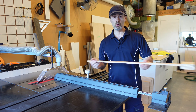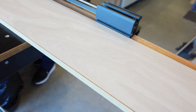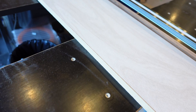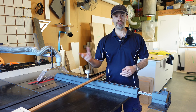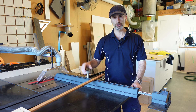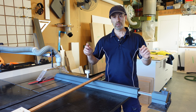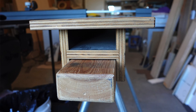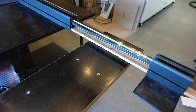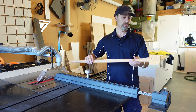So it's a quick and simple little hack to get a little bit more length in your material when you want to do repetitive cuts beyond the standard stoppers. You will need to support it though, because it does want to sag. What I use for that is a couple of sawhorses in the workshop — I've made a little board that's the same height as the table saw cast iron top, so your material comes level when it's coming to cut.